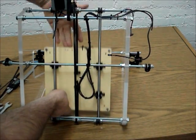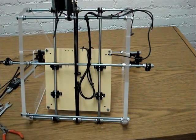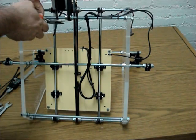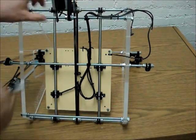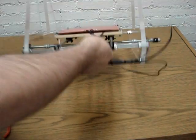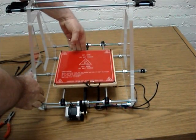That is not bad. Sometimes I'll go a couple weeks and then I'll adjust it after it gives time for the belt and everything to work its way in. And with that, we are going to maybe tighten this up one little click, and we're going to cut it off. I always cut this one off and leave a little bit of a tab just in case I have to adjust it later. So there you go. Now we have the motor lined up on our bed.